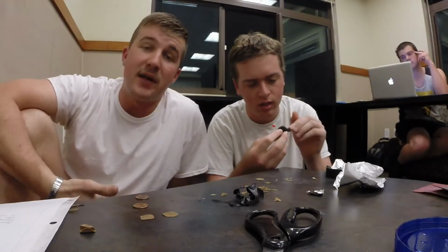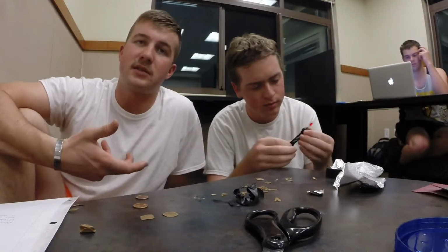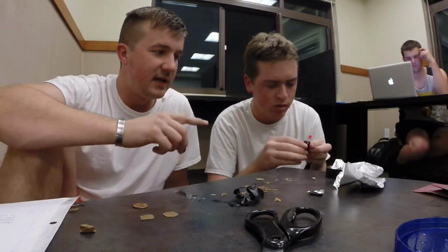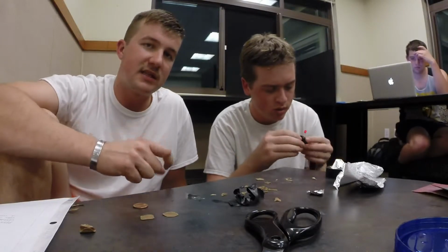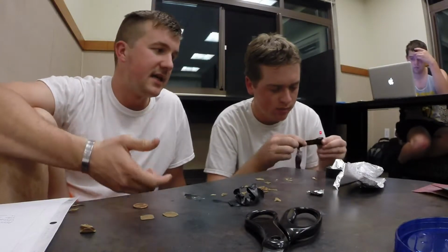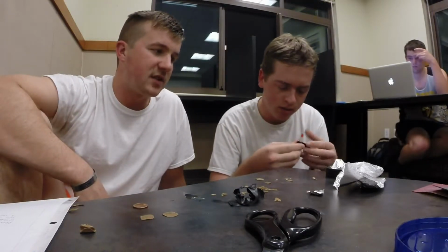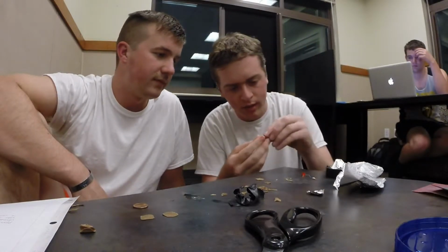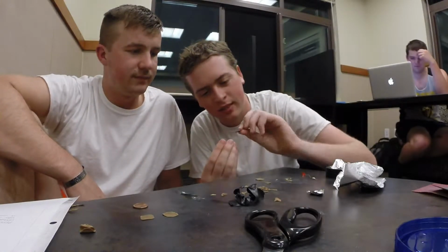Awesome. Okay, so the science behind this is that the pennies are the electrodes and the cardboard is the electrolyte. So when the LED is connected, it completes the circuit. And actually, the pennies that we've sanded down and exposed the zinc on have started to change color because the zinc is actually corroding, giving up some of its ions to produce this electric current. We can actually see this right now. So if we look here, that used to be all nice and shiny, and now it's not, because stuff's plating onto it.